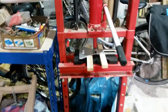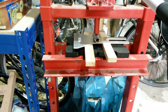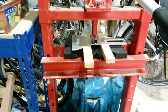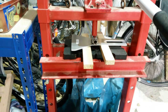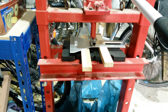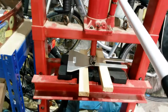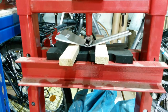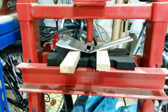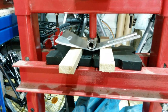Down the far end here is the hydraulic press. You can see I've put the part in the press - it's sitting on two blocks of wood. I'm using an inch diameter socket, in fact it's a spark plug socket, placed in the position where I want to put the bend. It's supposed to be a half inch radius bend, so we've got a one inch outside diameter socket on there. I've made myself a little template so I know when I've got to 35 degrees. It's taken about five goes to get it to the right angle, but that is at 35 degrees now. I've released the pressure and checked it against the template - all is good. So we'll be going back to the workshop to get on with the next bit.